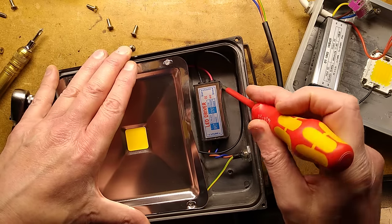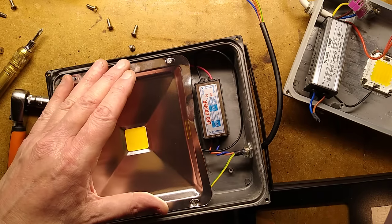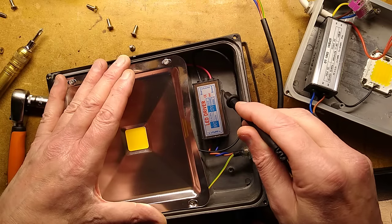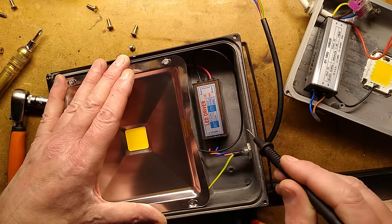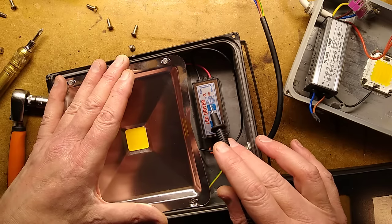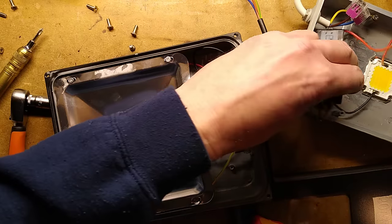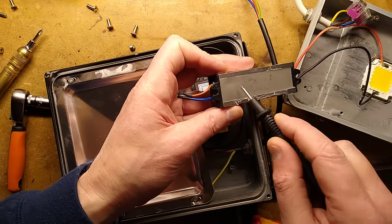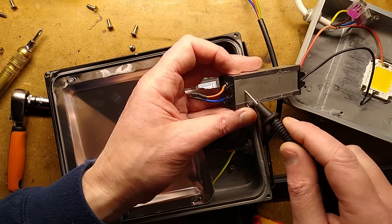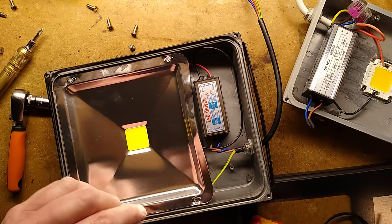This is going to be a super low-class, electrically noisy driver. Is it silicone or hot melt? Hot melt would be great, but also terrible for probing. It feels a bit silicone-y — that's going to be hard to get off; I'll need to stick a spudger under it. I'm going to see if I can find an alternative driver, but if not I'll stick this one in. I kind of prefer the one that was in there before.